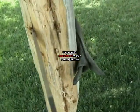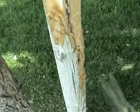A lot of people who do bushcraft specifically want steels that are easier to sharpen because of that aspect. They want a knife that they can sharpen easily, not have to use a diamond rod or something. A tool steel doesn't really belong in an outdoor setting, as opposed to something more corrosion resistant like N690CO, which they say is stain proof, or this VG10. There's nothing you're going to be cutting that needs such tool steel ability compared to indoor settings or maybe perhaps in the military, where a tool steel would be more important.